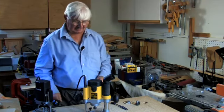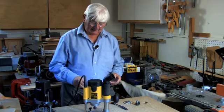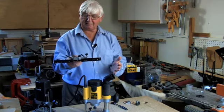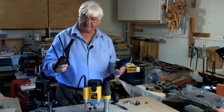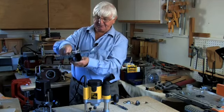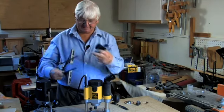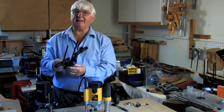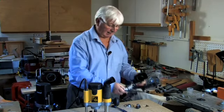The hose connection can swivel as you move your router around, and it's very easy to simply plug your hose in — you don't have to screw or clip on a plastic base as you do with most routers. Among the standard accessories is a side fence, and they've carried on the dust extraction through to the side fence with a clip-on spout. So if you're using this to mold the edge of a tabletop, with your fence in the router and your spout connected to your dust hose, you get excellent dust extraction.